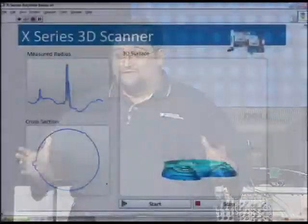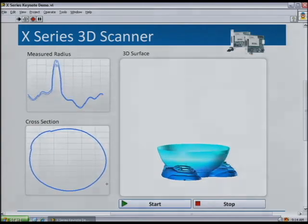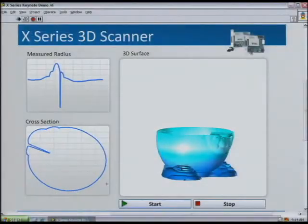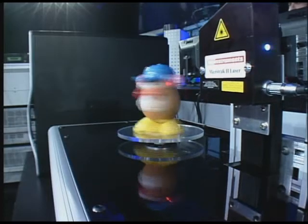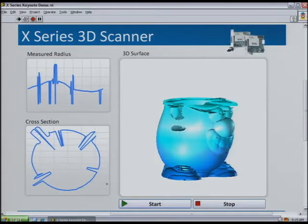While I get this started, Daniel, can you tell everyone about the counters and other new X-Series features? Absolutely — that's why I woke up early this morning. We have fantastic analog input, and we added our new NISTC3 technology. We have four counters per device with buffered counter output, single counter finite, 100 MHz time base, and re-triggering on every subsystem. Digital I/O has its own timing engines and analog triggers, and you can filter pretty much any digital signal you could possibly want. We revamped our streaming architecture from the ground up to give us our best performance yet, especially in real time.